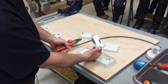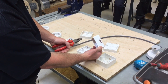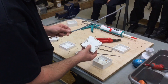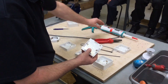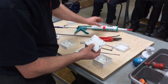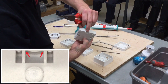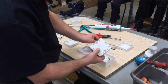There must be a better way of making the hole in the box to facilitate the cable. We need to cut out a hole that will be a reasonable size to facilitate, in this case, a 1mm² cable, but without leaving too much room — because obviously we're going to need to reinstate the IP rating using a silicon sealant. I'm going to cut down, break off the top lip gently with pliers, and then file it out using a needle file so it's nice and smooth.